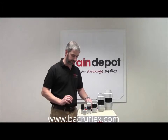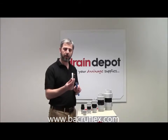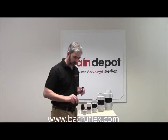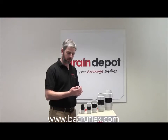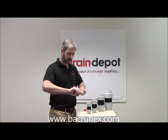Quite a simple product to install. Simply get your piece of pipe, insert your pipe liner — that's sold separately. I will push it all the way in because I will never get it back out. Slide your nut down the pipe, clip over your grip ring, and insert the pipe into the body of the fitting.